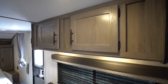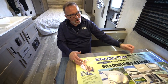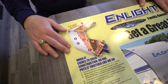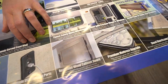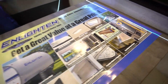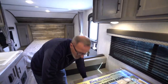Behind there you'll see the TV backer with cable connection and 110 power. Gulfstream has really done a good job: they've got 16-inch on-center wood studs with R7 blown fiberglass insulation — very similar to what you have in your home. They've got a 12-year limited warranty on the one-piece roof. The floor is OSB with Polymax — durable and easy to clean. They also put steel hurricane straps on the frame and reinforce the corners of the windows, which helps with sturdiness and prevents water leaks.